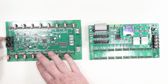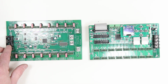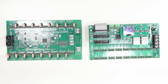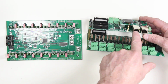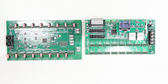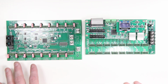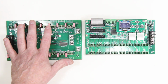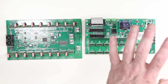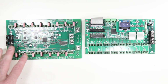We can also daisy chain. You'll see that there are 2 plugs here. This allows you to come from one unit, daisy chain out to another Pixie type controller or Light-o-Rama controller, either on an LOR standard network or enhanced network. And the AlphaPix also features 2 Ethernet jacks, which is basically a switch inside. So, in terms of capabilities, there is no comparison. This controller has the ability to control a very small number of pixels, in the hundreds. This is able to control tens of thousands of pixels. So, now, let's go on to the actual operation.